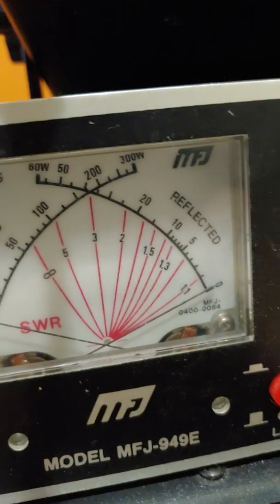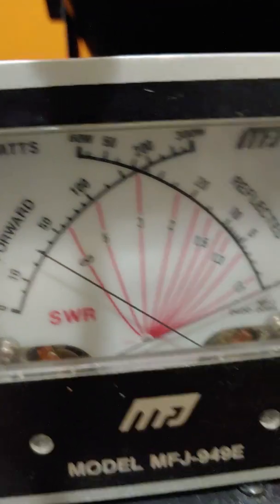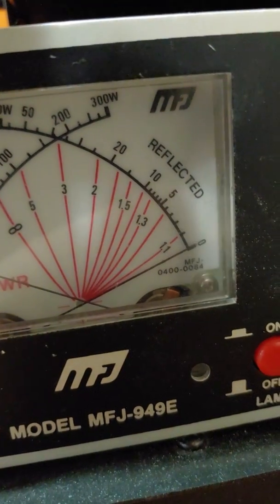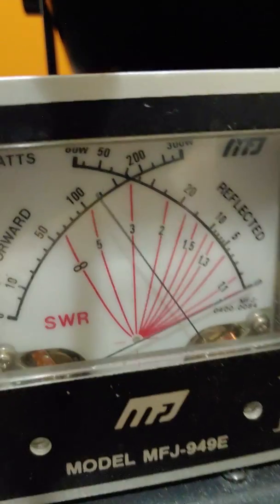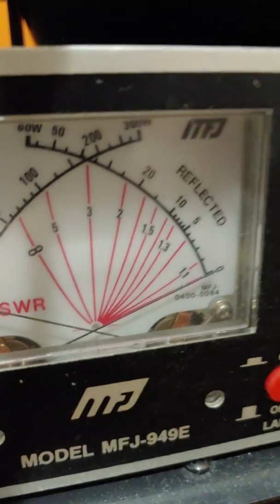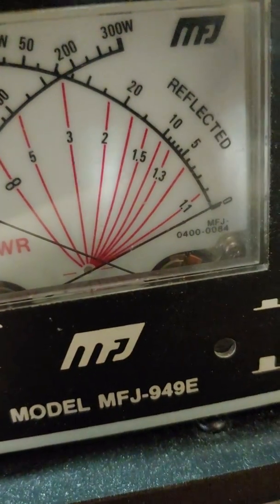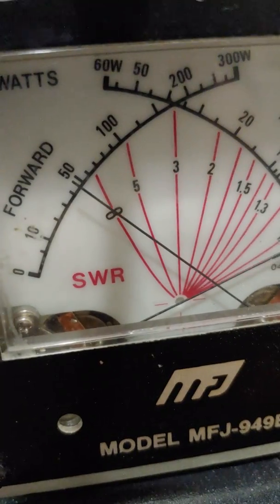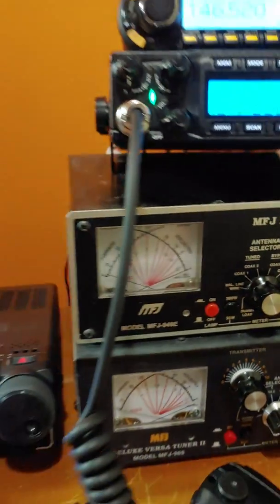Switching to the 30 scale — 5 watts halfway up, going above 30 even at halfway, almost 40. And then again, 50 watts. So that's your wattage readings through dummy load at peak, through an MFJ-949E.